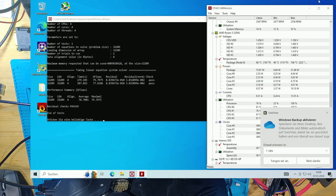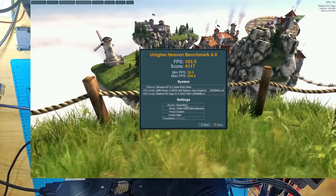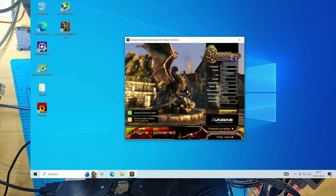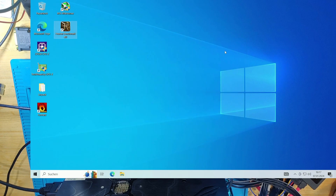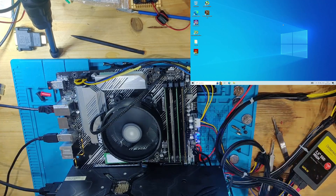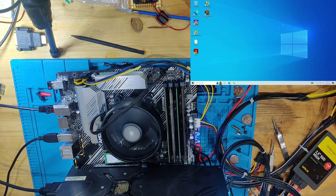Two passes of Linpack Extreme have completed without a problem. Moving on to the GPU test — Heaven benchmark has also passed. Ethernet is connected and also working, as you can see in the bottom right. We have 20 gigs of RAM and everything works — USB, Ethernet, all slots. Yet another board killed by a knocked-off resistor, but it was quite easy to find and quite easy to replace. Thank you very much for watching this repair — hope you liked the video, subscribe to the channel, and I hope to see you in the next one!